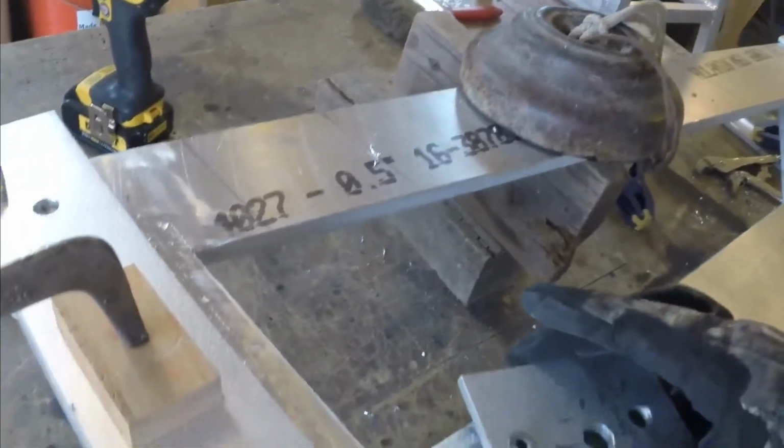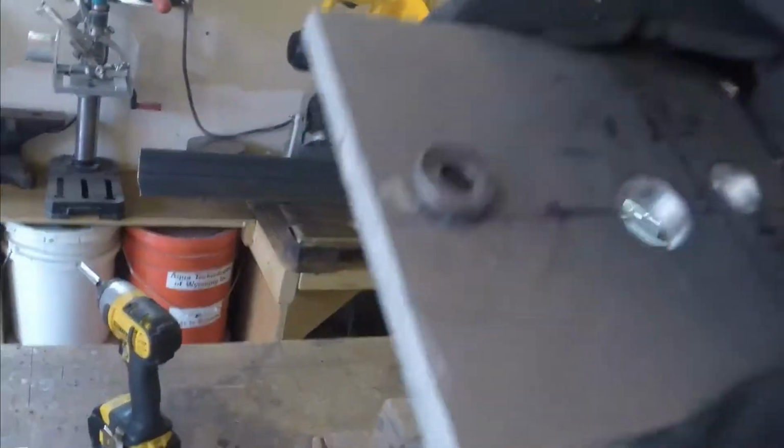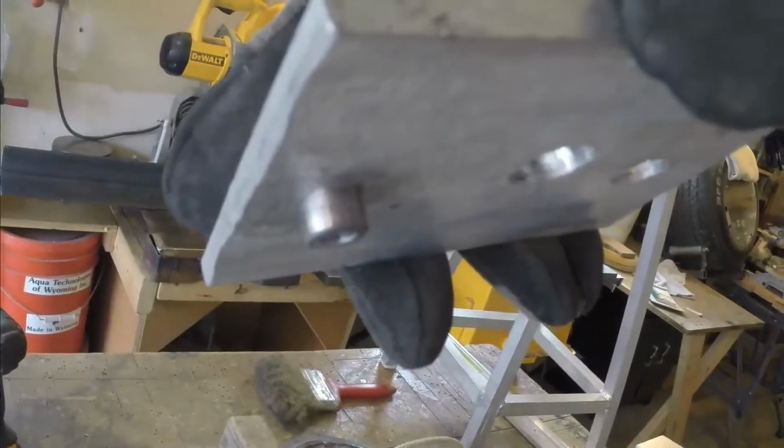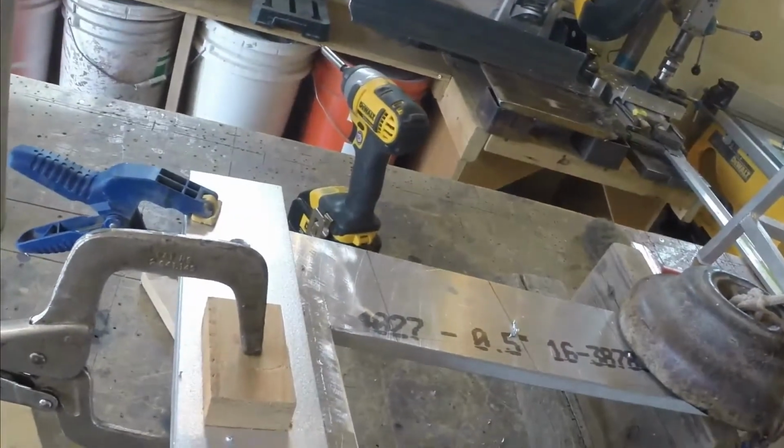This is a drill bushing, and I think it's set for a letter F size drill bit. It's a drill bit to use for a 1/4 hole. So the drill is pretty small. What I've got is the drill bushing put in a piece of 1/4 inch. There's a 1/4 of an inch sticking out of the bottom of it. Then these holes are 9/16 holes.